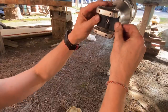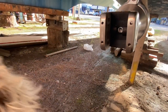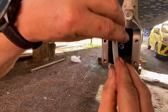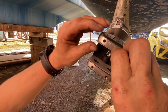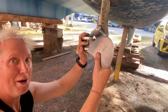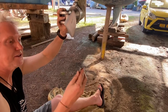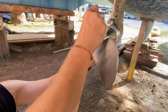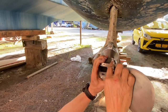Next is the bump stop pad, which will actually hold that in place. Turn it to the side, we'll grab the two side thrust plates, and line them up. Then we get a blade — you can't go backwards, there's only one way to do it because they need to close over each other. Then we grab the blade pivot pin and we wiggle it down to the first blade, to the little slot here for the grub screw.